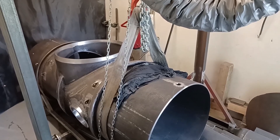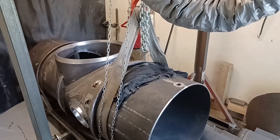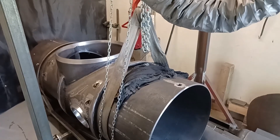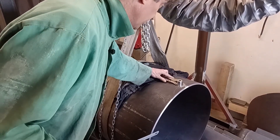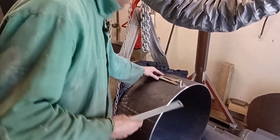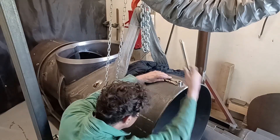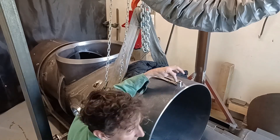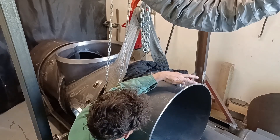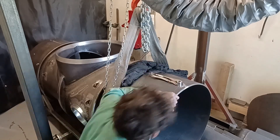My camera is flat so I have to have it plugged in, so I can't move from this location. I haven't specified what this distance is to be because it does depend on the valve. 25 millimetres — I think that's probably about right, because I don't want to go too far down as there's the O-ring groove and I don't want that to distort. So I'm going to go about there — that's 25mm down — and I'll add that onto my drawing.